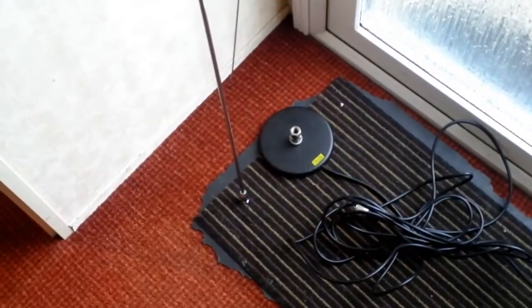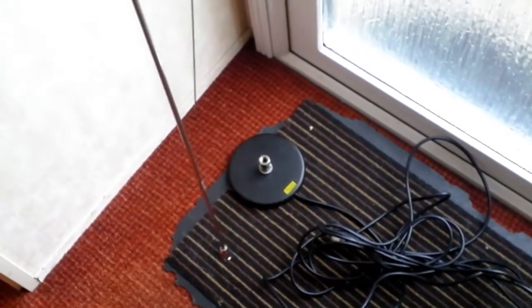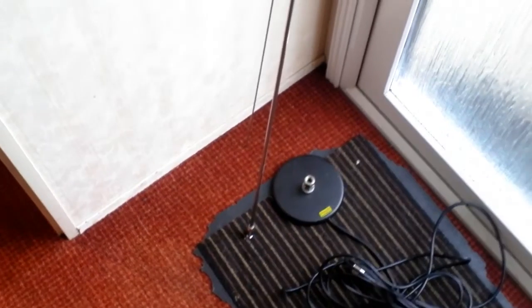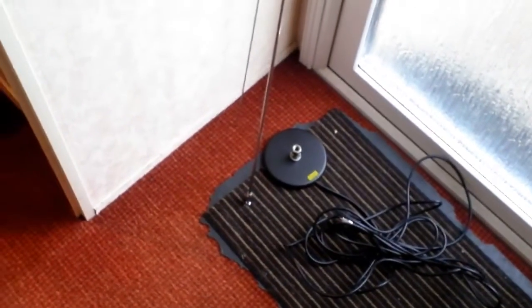Just using the tank whip antenna — there's absolutely nothing complicated about it. It literally is a stainless steel rod going up to a little grub screw with another little joint at the top, and then a normal steel whip like you'd get on a mag mount antenna. No coil, no base coil loading. It stands about seven foot when up — probably not something you'd want to drive about with on your car.